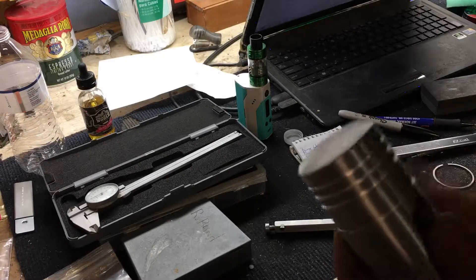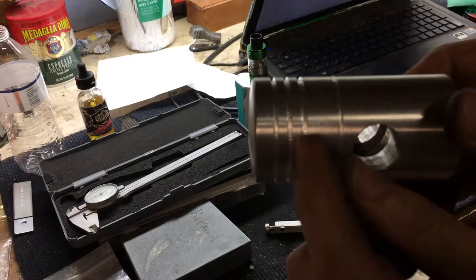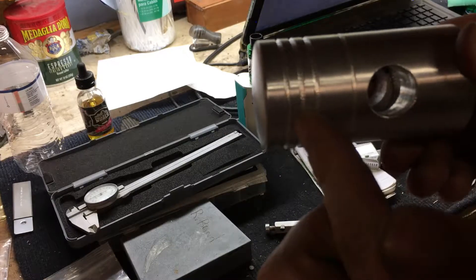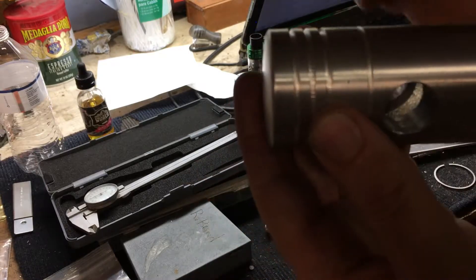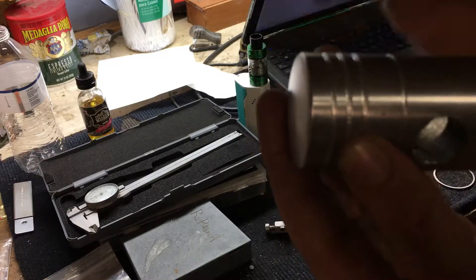Another day, another issue. I was testing my ring cutting and you can see the chatter in here. I think an experienced machinist could tell you that the cutter angle was too flat to the cylinder and I need more back rake. So I've decided to take more guesswork out of this — I'm going to make a specific cutter just for the ring that I'm using.